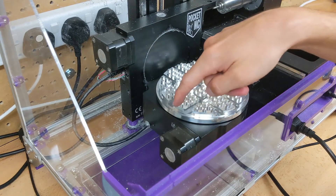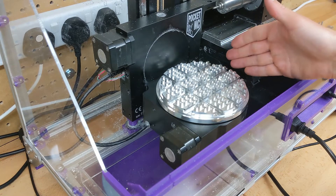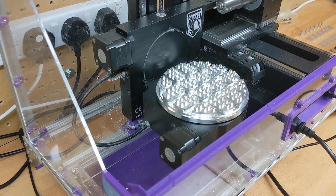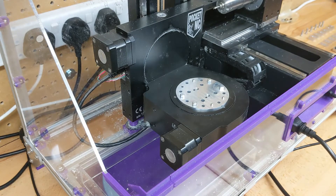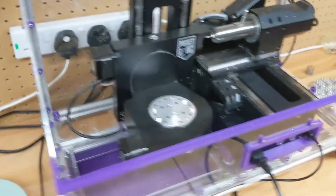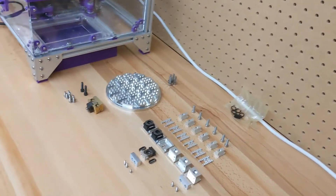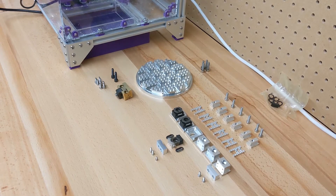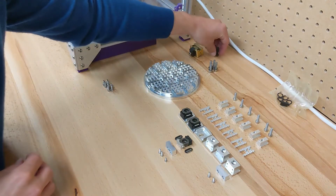Reducing the size of the diamond pins and screws means less clearance is needed in the fixture plate, so the overall thickness of the base fixture plate can be reduced by about two and a half to three millimeters. I'm also knocking about a millimeter off the height of the notches, and the notches will go right out to the edge, giving you an even bigger surface to locate your stock on.